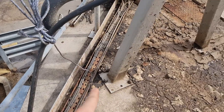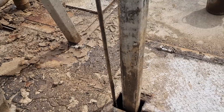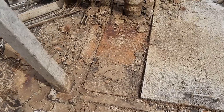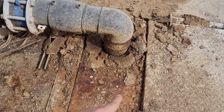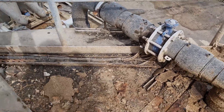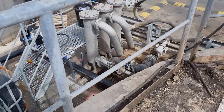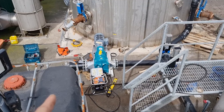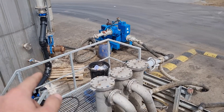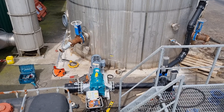That's our pipe - we've just got that one on weld. We're coming up here and into the top of this overflow tank. We need to get a hole in here, and I'll probably end up having to drill it because we're in the explosive zone - there could be gases still built up in this chamber. We'll stitch drill it out, bracket on top, and just bring it along. Once we get this one up here we'll look at getting the other pump positioned. We just wait for the other stuff to come - it's coming together, just really hot.